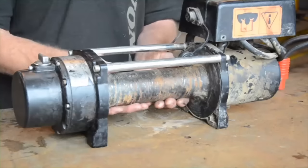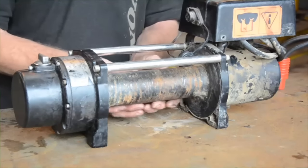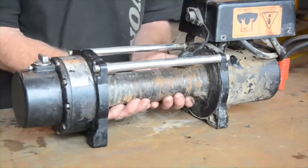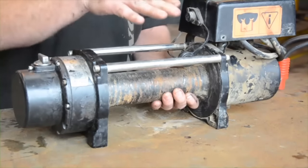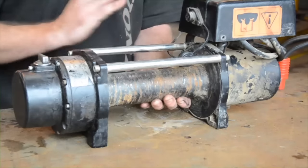Within this drum is a brake assembly. When the winch is being pulled in, the brake assembly is released. As soon as it's stopped, the brake is applied, which stops your 4x4 going down the hill if you're being pulled up an incline.